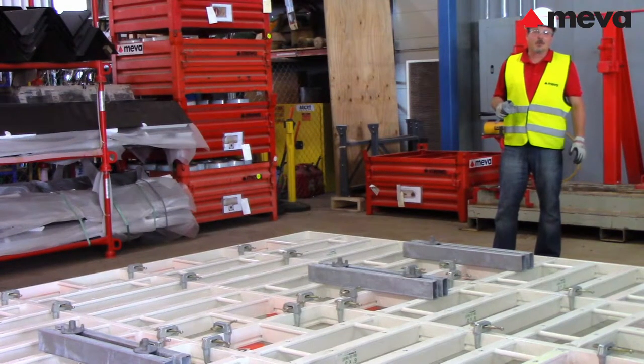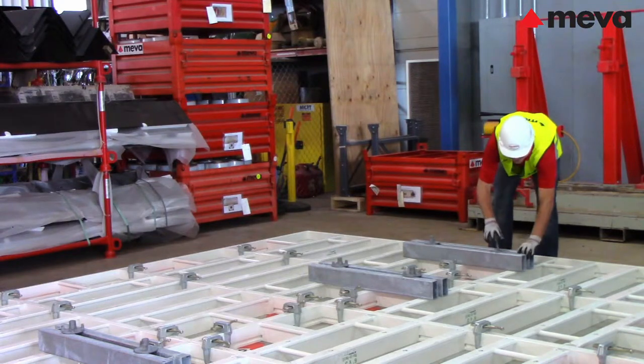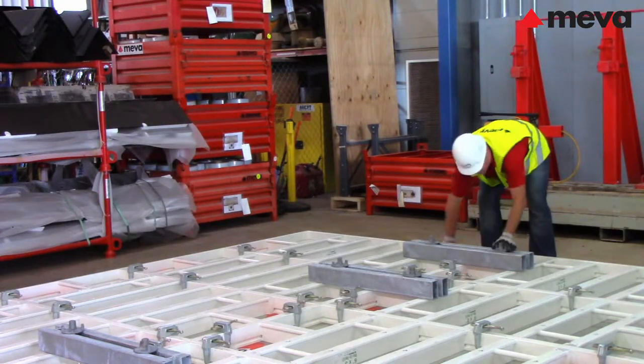For connecting rails, the maximum average rail spacing is 6 feet. Rails should be installed on each end of the panel gang. Be sure that the flange screw is connected to the multi-function profile and tighten it all the way down so that the rail is firmly connected.